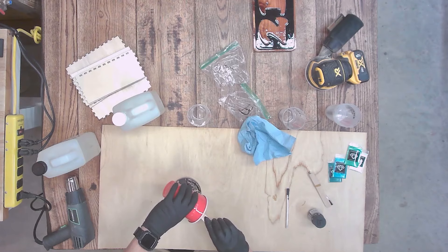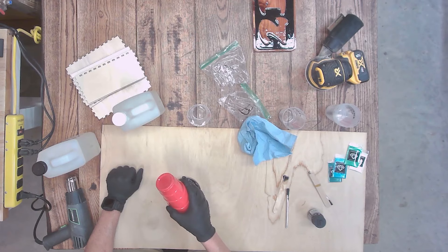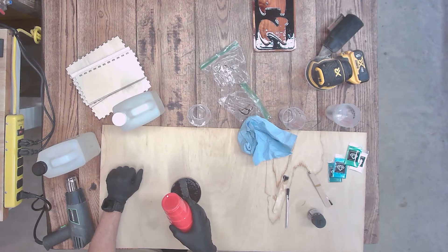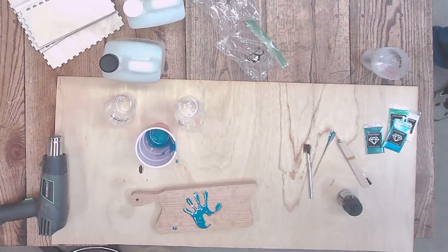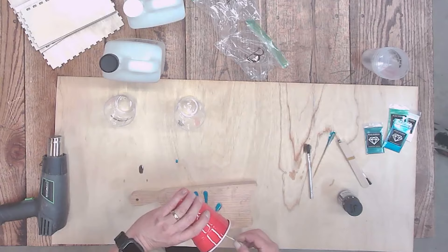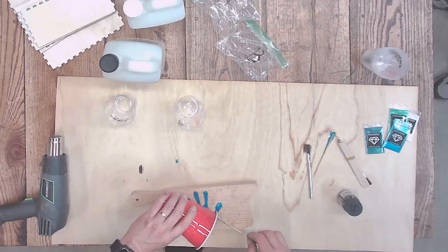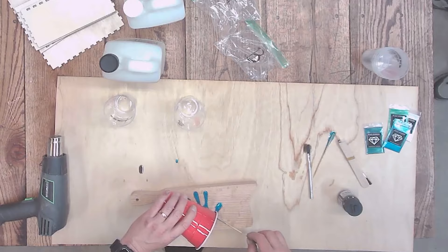This one's pretty simple - I've got black leftover epoxy that I didn't want to waste and I'm just going to flood-fill this thing, trying to get it to settle as deep as it will into the engrave. This was a fairly deep CNC engrave, probably about three millimeters deep. I'm getting as many air bubbles out as I can, trying to get it to sit flat into the wood, then hopefully I'll have something cool once I run a flattening pass. I'm using Solo cups - they seem to work pretty well.